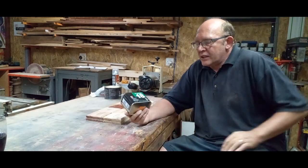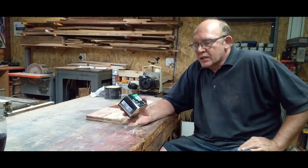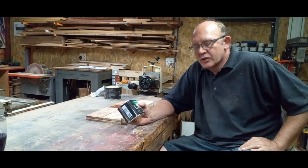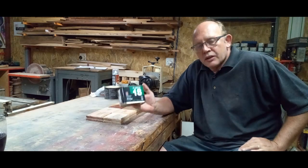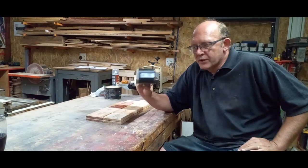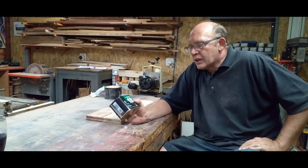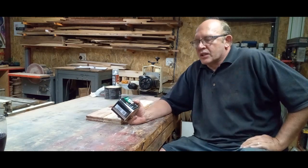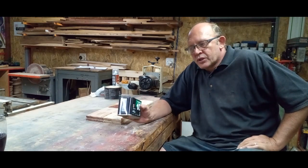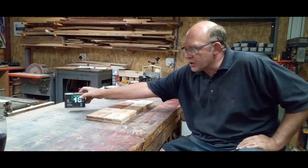it's a solvent based stain, and they call it basically a wood dye. It's in no way a finish, it's just a stain. It doesn't hide the grain of the wood. You can actually see all the grain of the wood still. But this stuff really works a charm. You get it in the major colors. The specific one I used was mahogany, just to get a bit of red into it, because the kiaat has got red and it's nice and dark. I use a normal sponge brush to put this on for a nice even coverage. Works a charm. Really worth using.